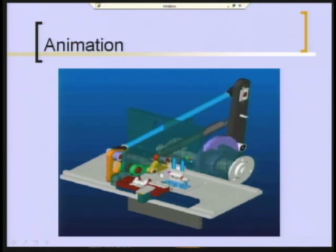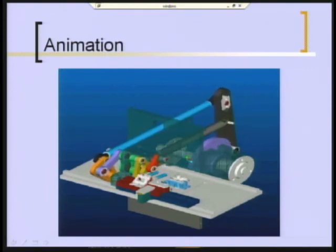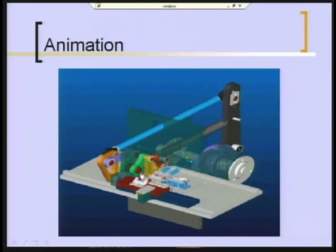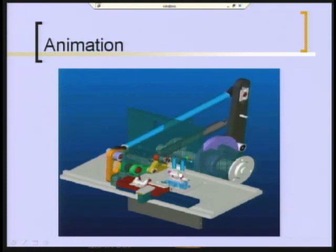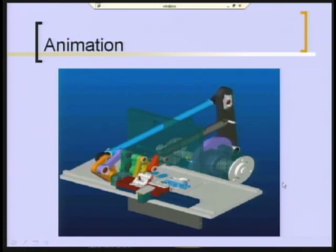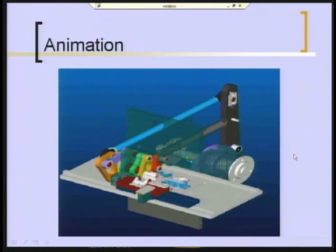So here you have a much more compact design, all of the business is accomplished right here with these very short links with good-sized pivots, nice bearings on the pivots. There is some cantilevering of the grabber off of the link. That was unavoidable in this case. But in general, this thing has very small beam lengths and thus is relatively robust and stiff. So a better solution overall than what was originally seen on the machine, which is, of course, the thing you saw demonstrated earlier.